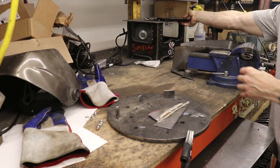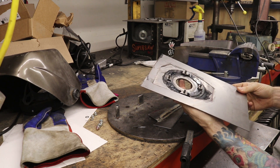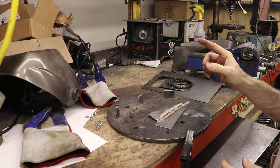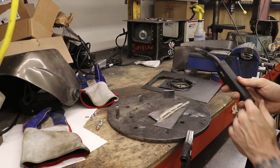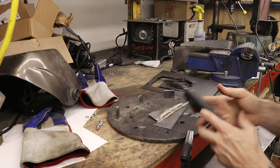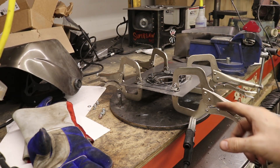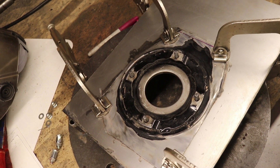Getting prepped for welding — everything's cleaned up and wiped down with mineral spirits. I'm going to lap weld these rather than join them precisely, since I'll be less likely to burn through and I don't have extra material. I've been practicing on scrap metal first. My technique is to tack weld every few inches, then fill in the gaps with short bursts of weld, letting it cool between passes — essentially stacking a dime. The thin metal can't take much heat.